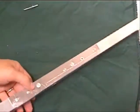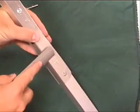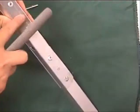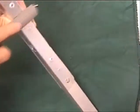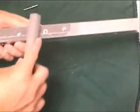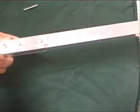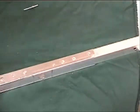If you do get a couple pieces where the mandrel breaks off kind of high, you can always just come in with a file and clean that off to make sure that nobody gets hurt, because nobody likes bleeding. So just clean that up, and it'll also help if everybody needs to go back through and drill that out to not have that sticking out proud.